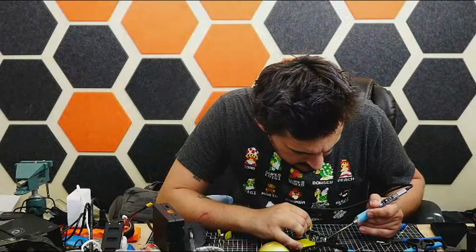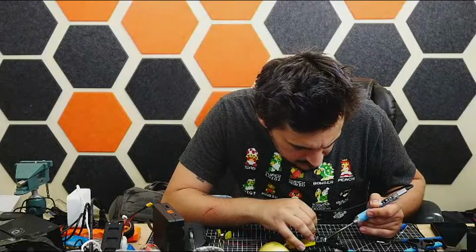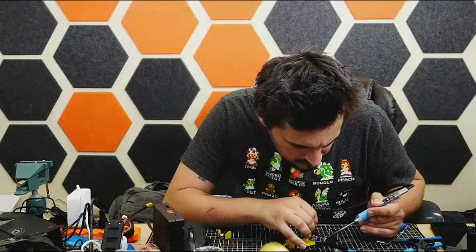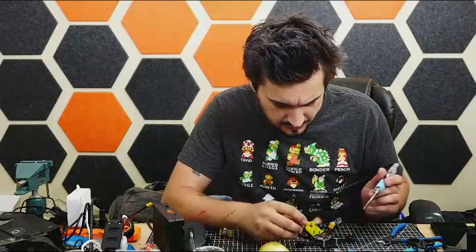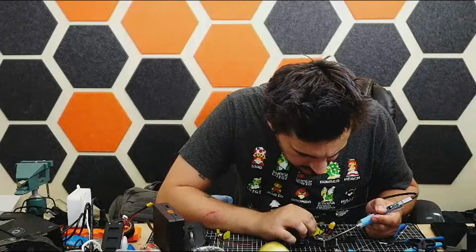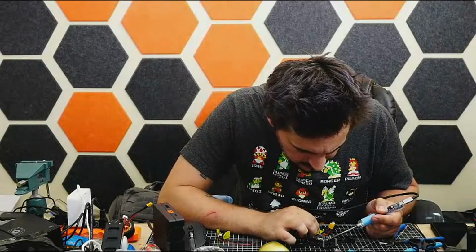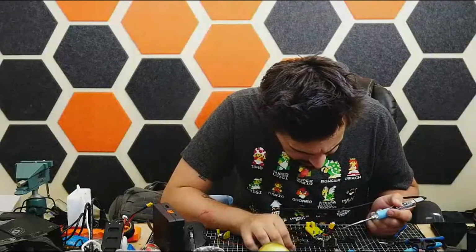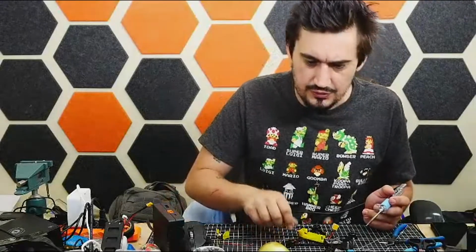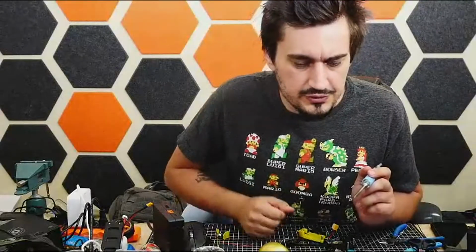So we're going to pre-tin the pads here. Camera's video feed will actually go through the flight controller, which will add an on-screen display, get a little information about what's going on, like your amperage draw, elevation, battery voltage, that kind of stuff. And then it'll feed back out to my video transmitter, which hopefully is sitting on my desk over here in these pile of parts.